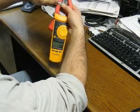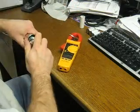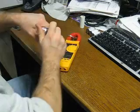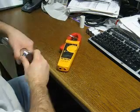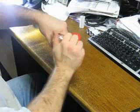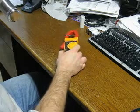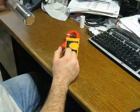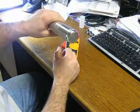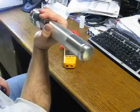When I screw this tail cap on and it starts to turn blue, it's got to be — not because of the heat, because it's an almost instant effect — it's got to be that the tail cap and spring are providing lower resistance and more contact force, and I'm getting even more than that 12 amp draw. Batteries are starting to sag finally. Even with the tail cap on, I'm not getting bluing of the emitter, but I am getting some serious heat generation.